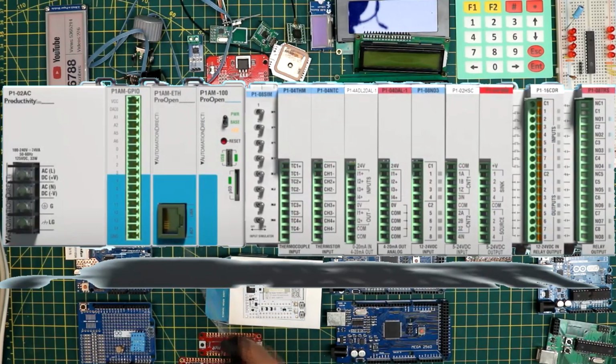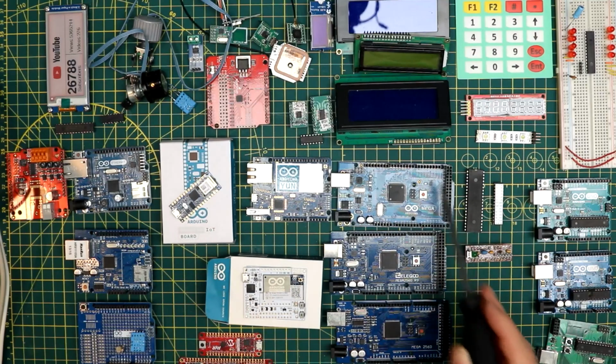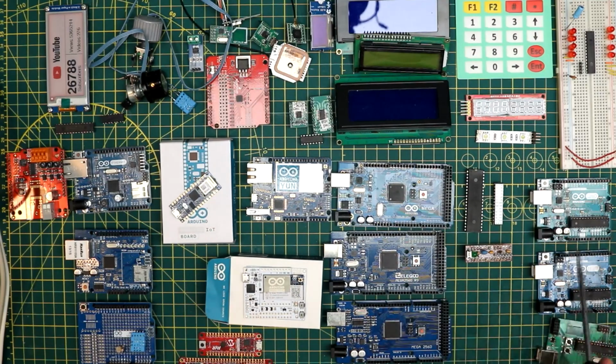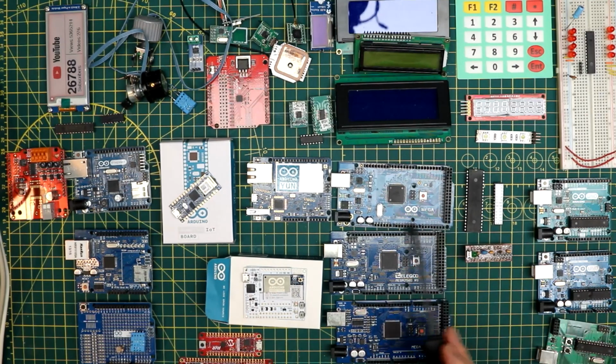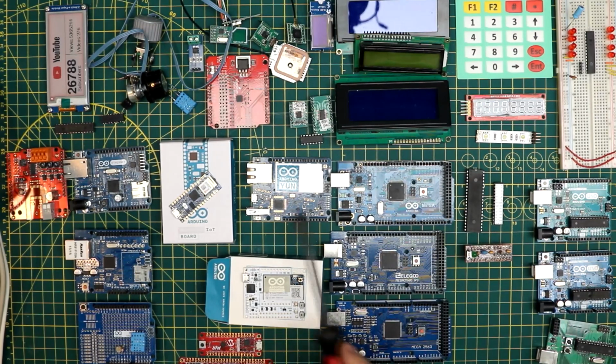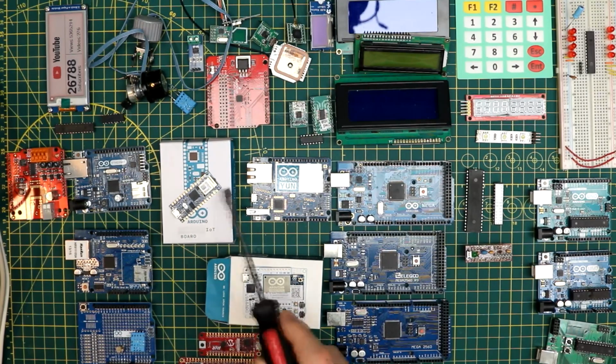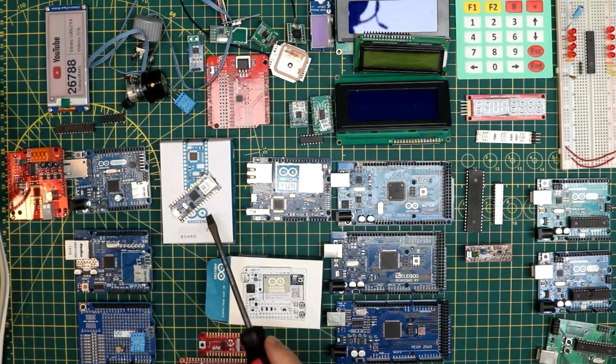So you can see here we've got it in a true Arduino compatible form factor. This is the MKR form factor, by the way, as opposed to the original form factor. The Uno and the Mega have the same pin configuration for these side pins. These top ones are different, and the end one on the Mega is also adding additional functionality, but they're compatible within these four. Same with the Yun is compatible within these four. This one, as you can see, the shape is completely different. It has the same kind of functionality in it. And yeah, that's the Yun.